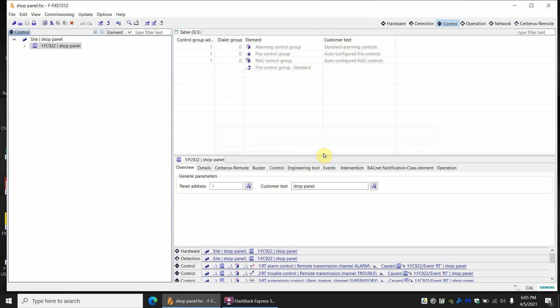After initializing, your panel will reboot again. After rebooting, look at the screen — you may have error messages saying Incompatible Firmware. From the PMI, you can hit the XU commands, put in your password again (all zeros), and you have the option to Update Firmware. You may have one or ten incompatible firmwares — it will update all of them from the panel itself; you do not need the computer anymore. Your panel programming has already been sent. So if you had a healthy panel beforehand, your panel should be healthy again after the firmware update. And with that, we are done with the firmware update.